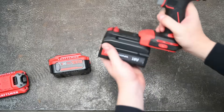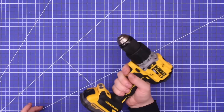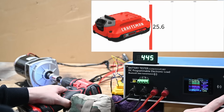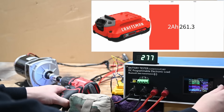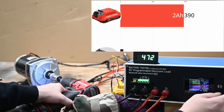A two foot-pound gap between OEM and aftermarket here. At 24 foot-pounds it beats a DCD805 DeWalt with any battery we've tested — a drill we like a lot, so surprising to see it low. On the watts dyno — a measure of how much work the tool can get done at speed — the Craftsman makes 390 watts with the 2 amp hour, with the gap to a larger battery being a bigger one.